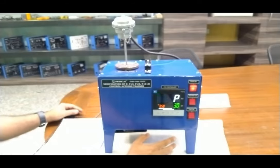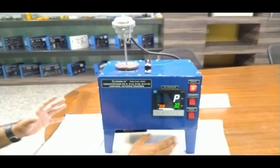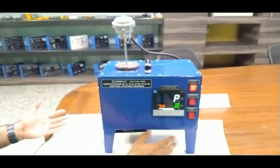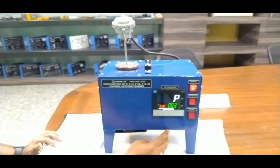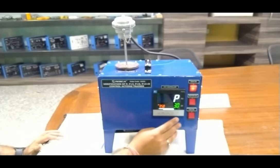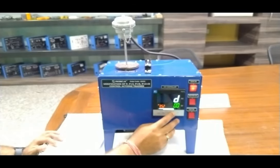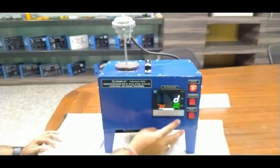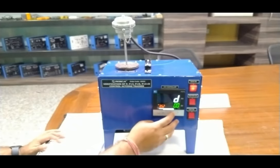We are now inside the channel one menu where different parameters are presented. We will set all parameter values as given in the user manual — these are the basic factory settings. We will enter P value as 3. Press select; the green value starts blinking so you can now change the value using the up and down keys, then press select to confirm. For I, it is set to 240. For D, we use the value 0. These P, I, and D values just need to be changed for each different practical.